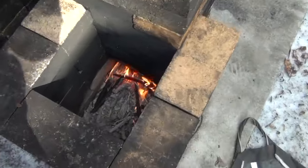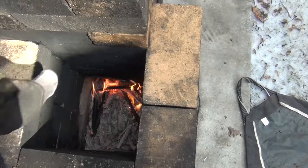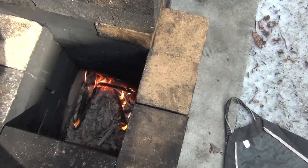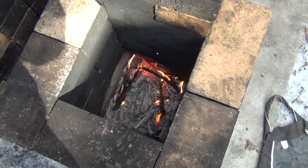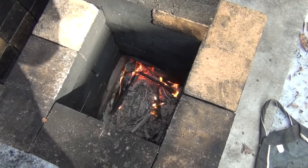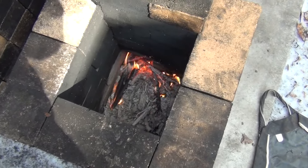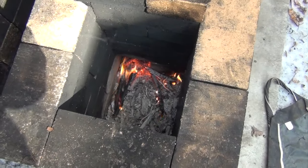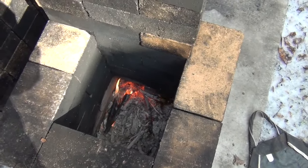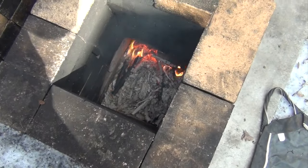And at the end, you kind of know it's a success when it's not using this as a chimney. One of the big issues with a lot of people that do the J rocket stoves is that the stove sometimes wants to use that first part of the J as a chimney. I'm not sure how many people will be completely honest once they spend all the time to build a giant J system with a barrel, but there's a lot of smoke that comes up into the house from time to time in some systems.